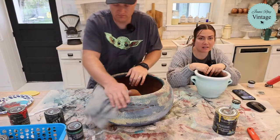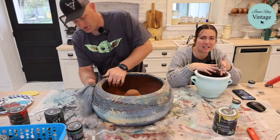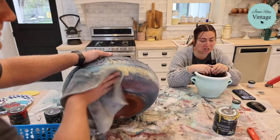Okay, so all these colors are now going to be friends. The rule with polyurethane and wax — we get this question a lot. Wax should always be last. Does it mean we have never painted over wax? No, we do it all the time — we break the rules — but wax is typically a resist. We don't want you to have a bad experience. So typically if you put wax down and then put paint or polyurethane over it, it's going to pull up and there are times it will not adhere.